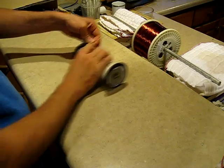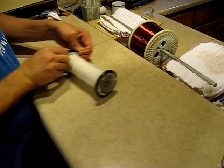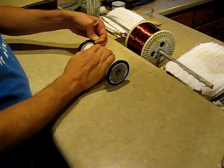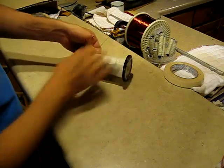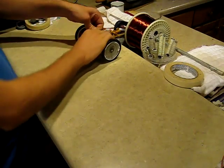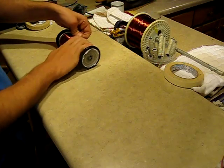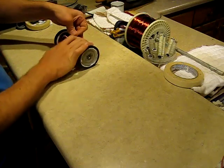I'm starting the windings just like on the primary — we keep them close to each other, nice and tight. We don't want any loose windings. I'm going to wind this until it's flush with the edges of our end plates. There are some separation areas because of the irregularities of the primary coil under the secondary. Don't worry about that too much — on the next layer across you can help fill in some of those, and through creative winding you can smooth all those out so that hopefully by the time we come out to the edge we have fairly straight, smooth edges.